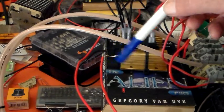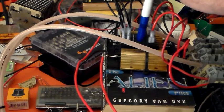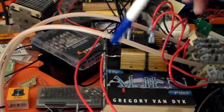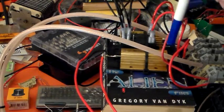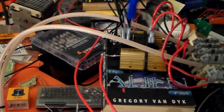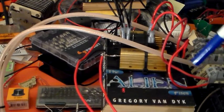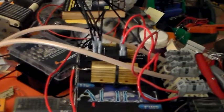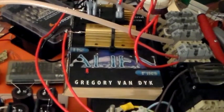Now this is turned off. Here's one of the 3.3 ohm resistors, here's the other one over there, and there is the relay. Now, because this is just a lash up to prove the concept, I've just soldered on the ends of the 3.3 ohm resistors on each side, on this side as well. I don't know if you can see it there, just a bit of 1mm building wire sticking out, because I've got to solder a couple of wires on here and a couple of wires on there as well. Now it doesn't have to look great, it just has to be robust connections, so there's no dry joints there.